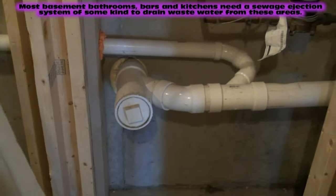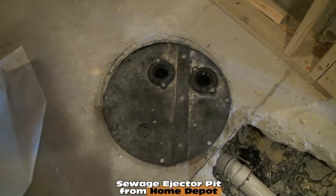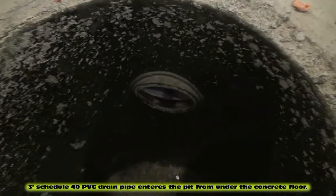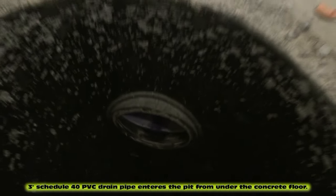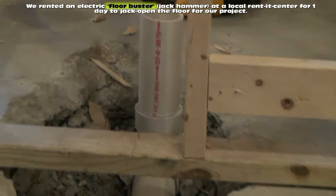We're going to have to pump up into that line using the sewage ejector, which will be in the floor here. You can see there's a sewage ejector pit right there — take the lid off. If you look down inside there, you can see the three-inch pipe coming through the rubber gasket that comes with the sewage ejector pits. And if you jump up over the top of the pit, there's where we run the floor straight over to our toilet flange, which is turned up right there in the bathroom. That's all three-inch PVC coming down and right inside the pit.